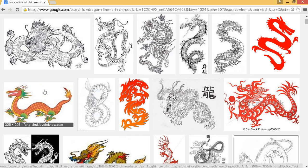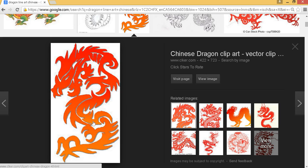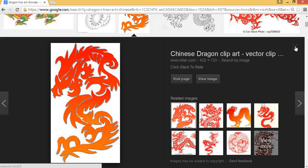The third thing we're considering is the colors being used. Ideally, anything black and white is our best option, because the fewer colors we deal with, the better. We also want to avoid what we'd refer to as a graduated screen. If I look at this image, for example, you can see the difference in shading between the red and the orange — this can be troublesome for the software. As we convert from bitmap to vector, we drop out colors until we're down to a two- or three-color image. With a graduated screen, the software has a hard time determining where to draw the lines and where to separate the colors.